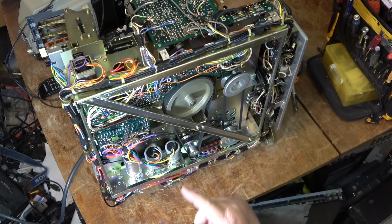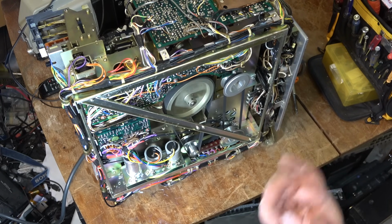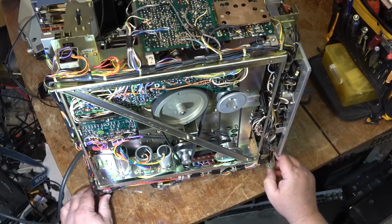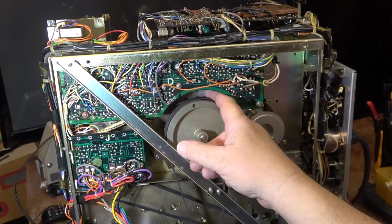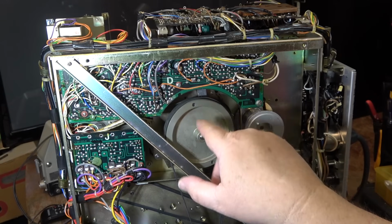I don't know if you saw that or not. I've got to lower the camera down, I'm sure. It just detected that there was a jammed tape, because the tape slack lever would have gone slack because there's no tape in it. But if we watch what operates the pinch roller, there's a roller back here that actually drives the pinch roller in place from the capstan.